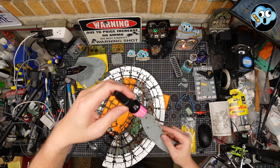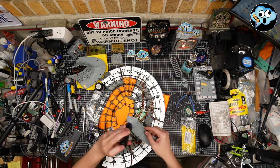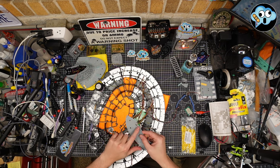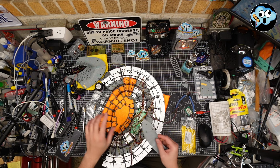We then incrementally filled the cavity, a little at a time, flashing it off with a UV flashlight from the back and from the top first. And from the back through the tape, and adding a little more UV resin until it's pretty much flush.